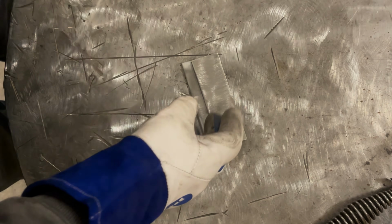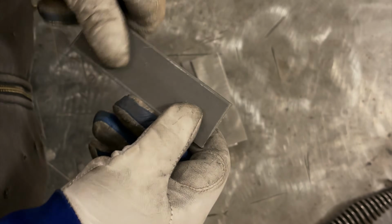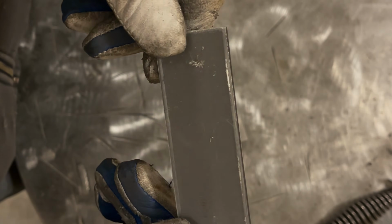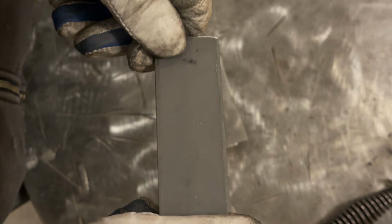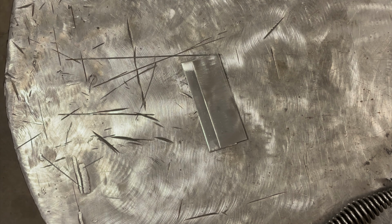This plate had a very thin, like you look at this, very thin mill scale. Like, I mean, it's almost worn through here. Might have been cold rolled. I mean, maybe not, but when you deal in thicker plate, like 1/4 inch and thicker, as a matter of fact, I'll grab a piece of it over here just to give you an example. This is definitely hot rolled.